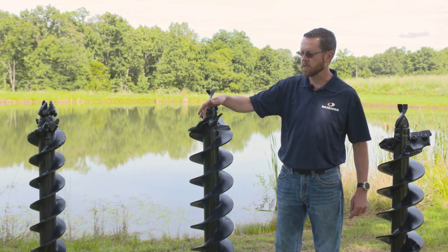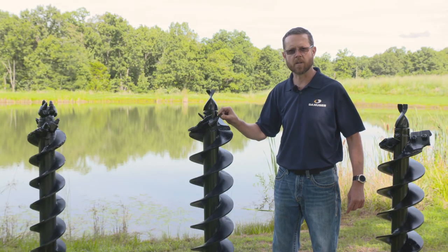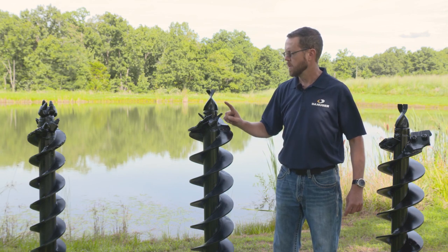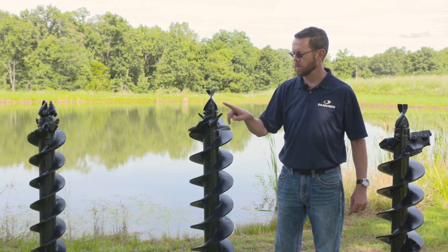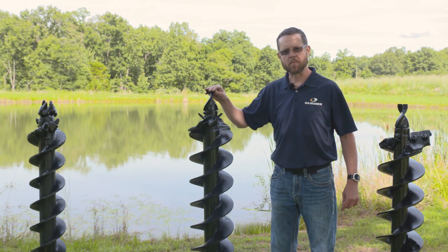This one again uses a gauge tooth on the outside position, which is very important — when this gauge wears off, you do not want to wear into the cast steel head or you'll have to replace the whole head. The middle teeth on this auger are more of a point, called a chisel tooth. These teeth come in dirt and hard face options, dirt hard face carbide, and dirt and hard face carbide pilots.